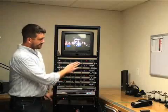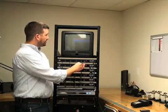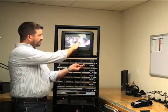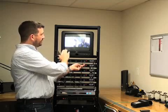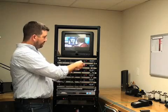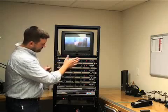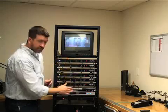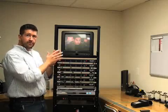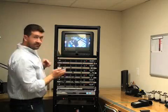The next adjustment is video modulation. As you turn it up and down, the screen gets dark or really bright, and when it's turned up too high, colors start to get washed out — sometimes you get green speckles depending on your video source. We want to get it where the colors aren't washed out but not too dark either. Go through every channel on the video modulation and try to get them all at that same point — not too bright, and colors not washed out.